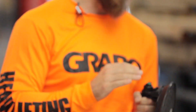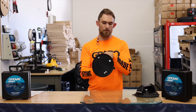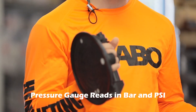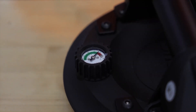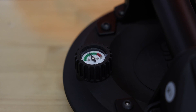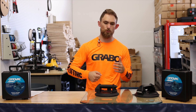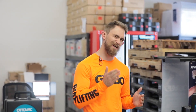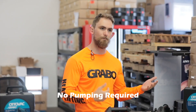The green button here is the on and off. It's also got a sweet gauge — the same Grabo gauge you get with the other Grabos. So you still have something to keep an eye on, giving you a better idea versus constantly checking for the red line. There was a time on the job site where we ended up dropping a piece because the guy didn't check his cup while pumping. He didn't pump it well enough, it bled out, and we ended up popping on the corner.